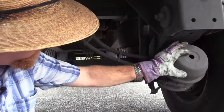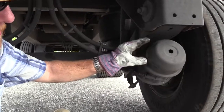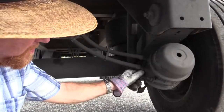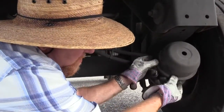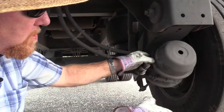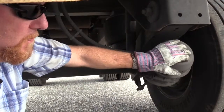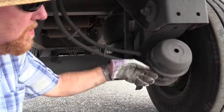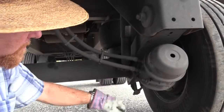The chamber itself is secured to its bracket. It is not dented or cracked. It does not leak. The bands that hold them together are present and secure. Now this one has a single band holding this side of the chamber together. This one's a newer style where they have crimped it together. They basically pressed it together. It's no longer a clamp. But it's very important. Your spring is in here, and that spring's under enough pressure to take your head off. So it'd be a good idea to make sure there's no damage along that crimping. And again, the band is present and secure.